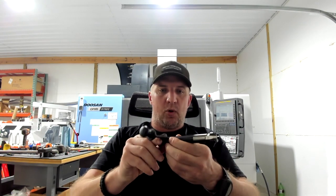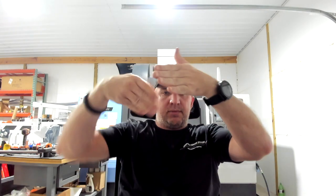One of the other innovative things about this action is the extraction options. On most bolt action rifles, when you lift the bolt you have a surface on the bolt and a surface on your action that interface at an angle. The bolt lifts up, hits it, and that causes it to pull the round out of the chamber — those are your extraction cams, your extraction surfaces. That's why when you have a stuck round in the chamber you'll see people hitting the bolt up.